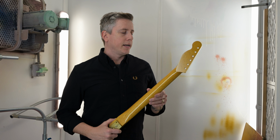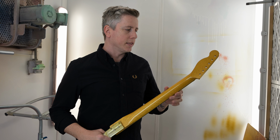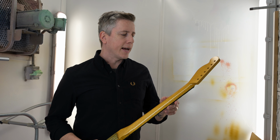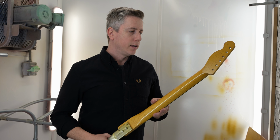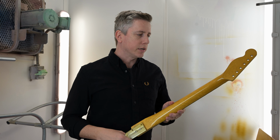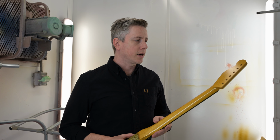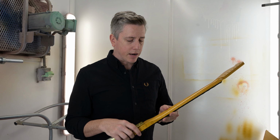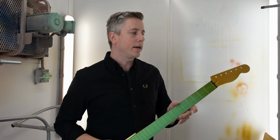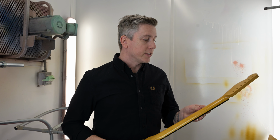Okay, so this has had a night to dry. Yesterday we did one kind of heavy coat on this neck. The neck amber is good because you can do several really light coats until you get that tone that you're after. I knew what I wanted, and I'm pretty well versed with aerosols, so I was able to tackle it all in one heavier coat. You probably saw in the video, I just kept moving around to different areas so that we didn't risk having any one area too wet. So we didn't risk any runs or anything like that. So this came out well.